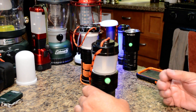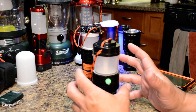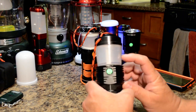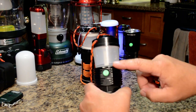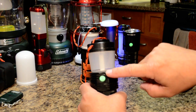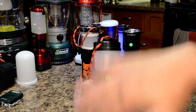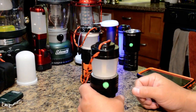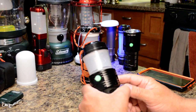Chrome creates a sparkly effect that's not pleasing to the eyes, whereas flat white smooths out the beam pattern in all directions around the lantern. Having both the top and bottom surfaces painted flat white creates an amplification effect — light reflects back and forth more, projecting more beam downward and upward at a wider angle around the lantern without losing as many lumens as a chrome surface does.